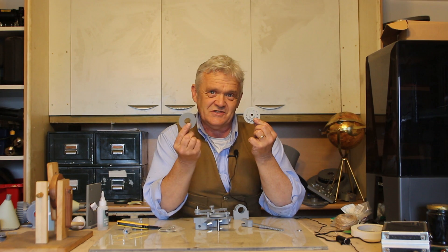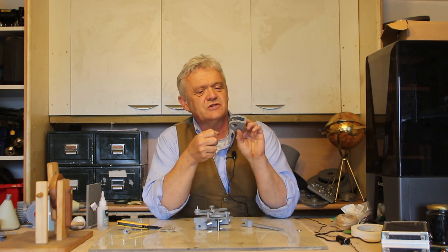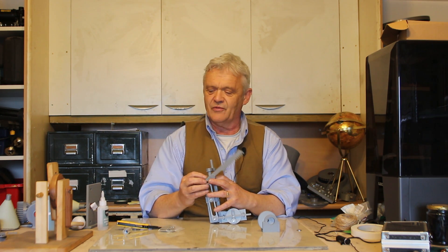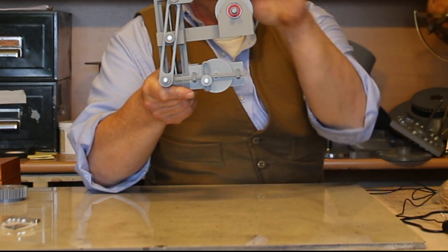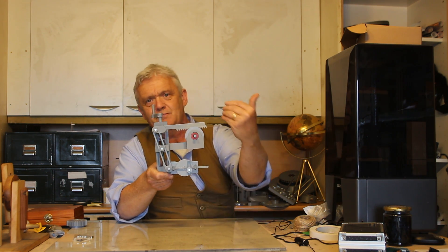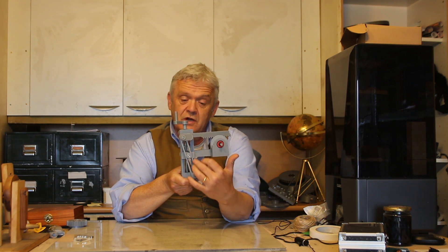The final parts you'll need are the ratchet and the ratchet cover — they just press fit — and a piece of 8mm bar goes through to make the ratchet carrier. It needs 22mm bearings in those holes, and the pull piece fits onto this section with the teeth pointing down, held by one of the shelf supports. As you turn the input shaft, it rides along on the ratchet return stroke without turning the wheel, then pulls it on the power stroke. The amount the wheel turns is set by the pivot position: the lower the pivot, the further the pull; the higher the pivot, the less it pulls.